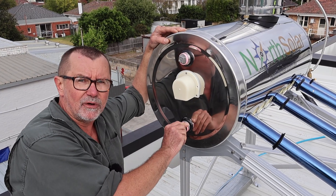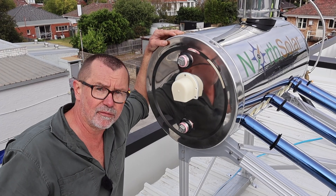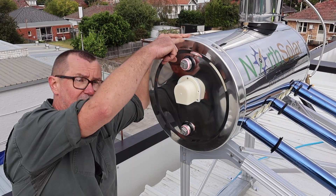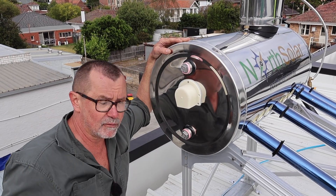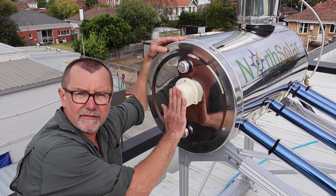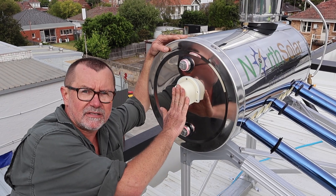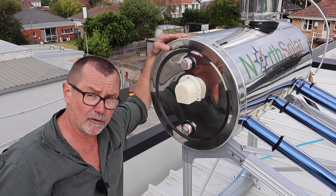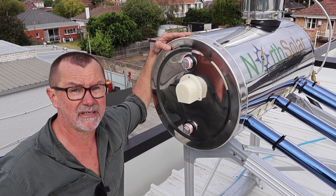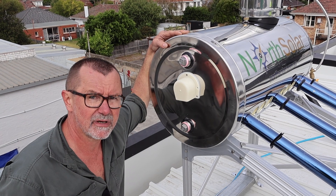These two fittings will actually be installed into a stove which can have the hot water heating up, and it will thermosiphon in and around, which means you save a lot of energy. If that's not an option for you, we also have facilities for an electric heating element, which will assist in boosting if there is very cold weather or consistent shady days. As soon as the sun comes out, you can raise the temperature to 80 or 90 degrees without a problem.